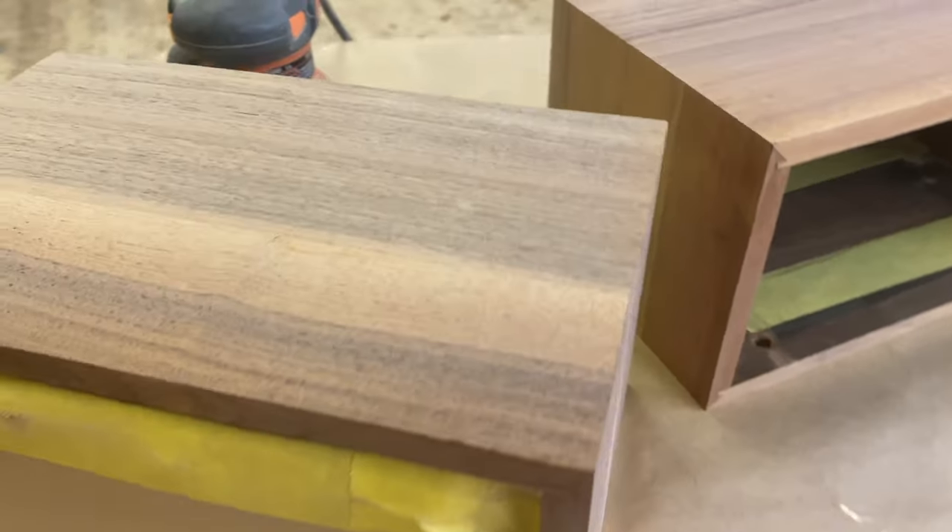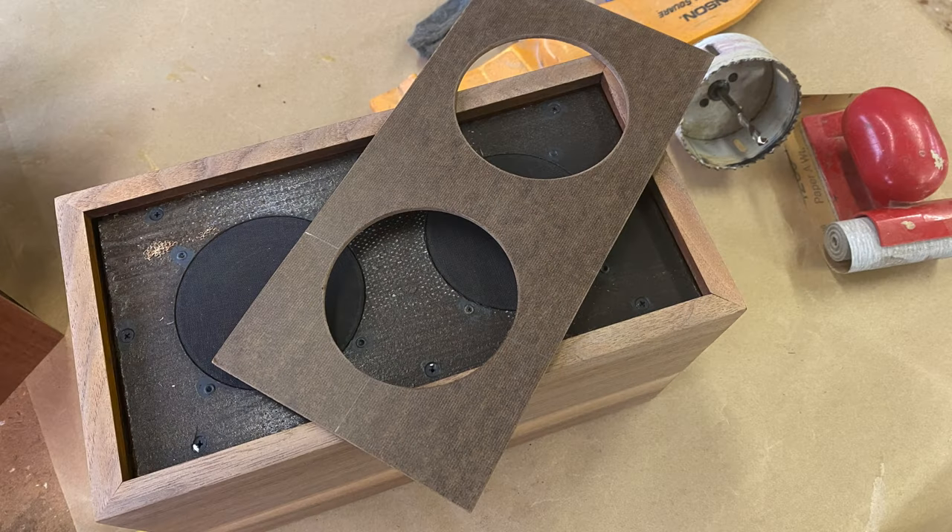Both cabinets have been completely sanded on all surfaces — prepped and ready to be refinished. You can see the beautiful coloring in the original walnut. Jay Kent outlines a really good strategy for replacing the grill cloth: instead of tucking a new cloth like the original inside the edge, he suggests building a masonite speaker grill frame, then covering it in Irish linen or a similar material. I used strong double-sided tape on the backside to get it all positioned, then spray it with water and run a heat gun or hairdryer across it — that causes the fibers to contract and everything pulls really tight.